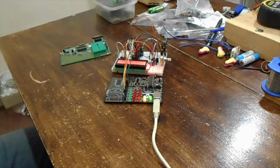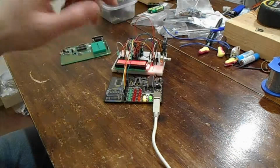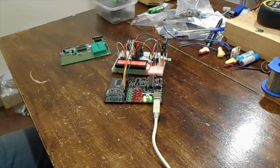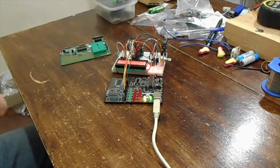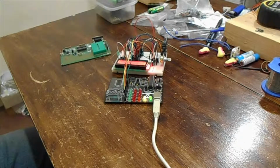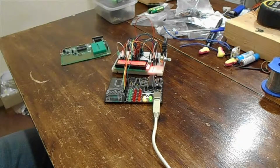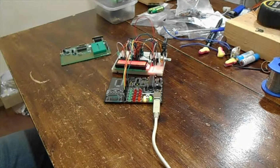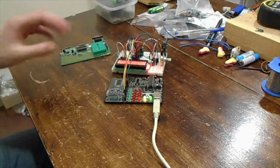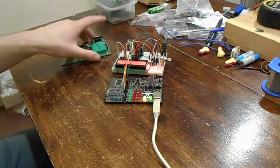It's not just going to say 3 volts and assume it's doing that. It will actually loop back, measure the output and display the output, because that way if there's a fault with the hardware, say for instance the short circuit protections kick in and every time they press the pedal down to get current out of the thing, the voltage collapses, it'll show on the screen. And likewise, if something malfunctions on the hardware, it will show there's an issue. It just helps things. But anyway, I got a bit off topic there.